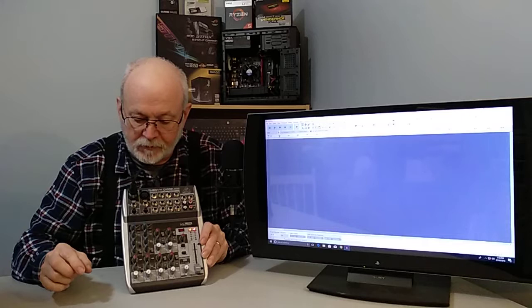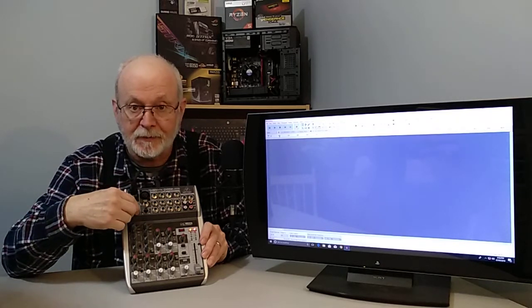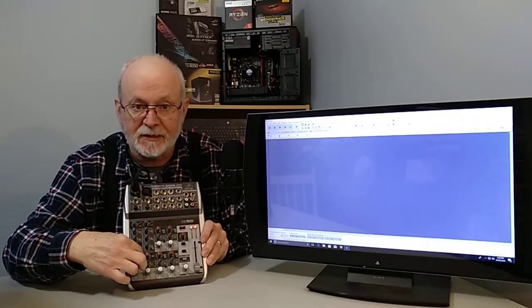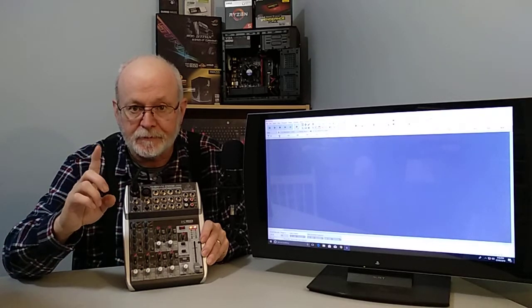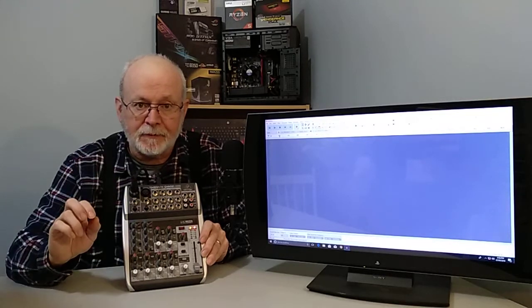So what we're going to do is start to turn this up. When we start to turn this up, we're going to watch this little LED down here, and whenever it starts to come on, I'm going to stop, because that means it's going to clip.